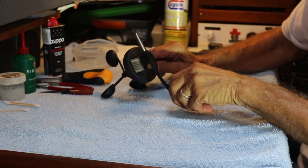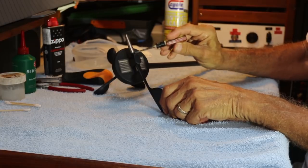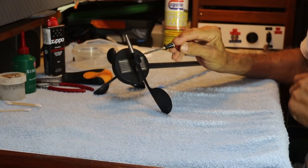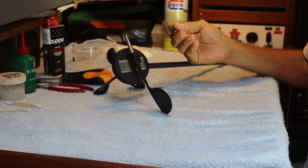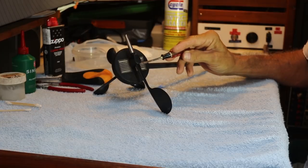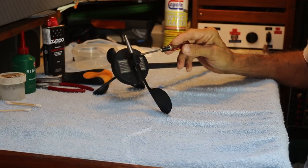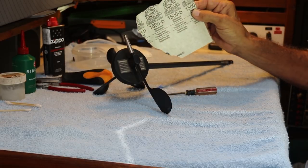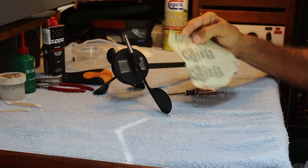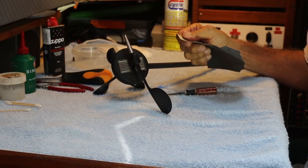Before we take this apart, I wanted to show you the solar panels that recharge the batteries inside. A few years ago these panels were opaque — very frosted over. They had been up on top of the mast for years. To clean them up, one thing you don't want to use is acetone or lacquer thinner, any of those harsh cleaners. What you actually use is sandpaper. I started out with 400 grit paper, went to 600, 1000, and then ended up using 1500 grit paper. Before I put this back on top of the mast, I'll take the 1500 grit and go over it again, just to get any new corrosion off.